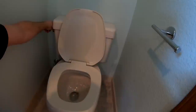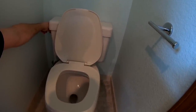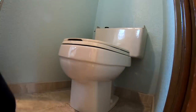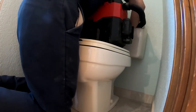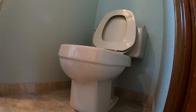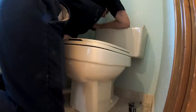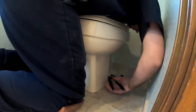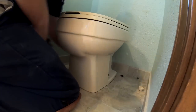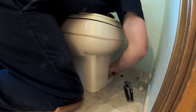Going back in with these new toilets, I actually had to use the new water lines I bought this morning, because these old water lines are not long enough. These old toilets are quite a bit shorter than the new toilets, so the old water lines just don't reach. Luckily I bought those new water lines and was able to use those — worked out great. Also, when using the Milwaukee wet-dry vac, I remove the filter in the vacuum, because if you suck up drywall dust after sucking up water with a filter in, you'll just clog it right away.